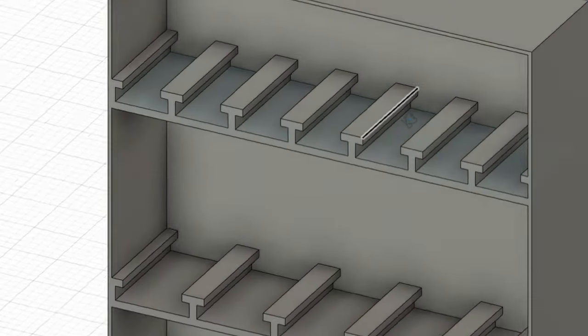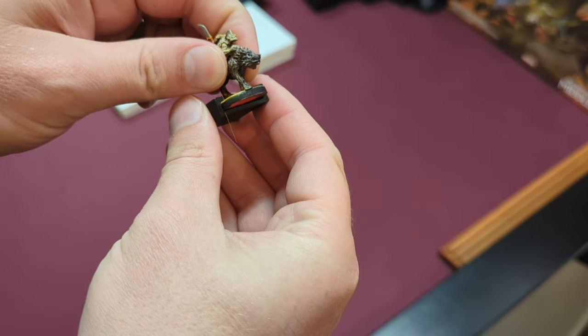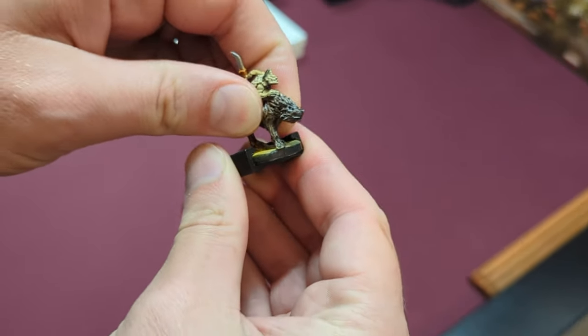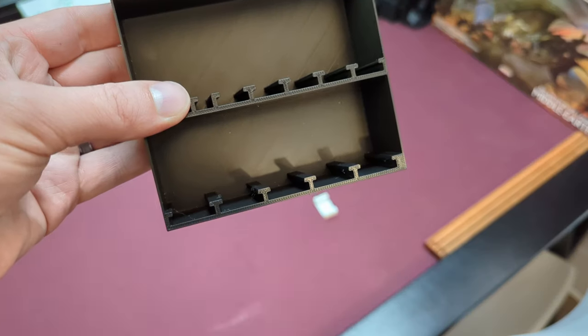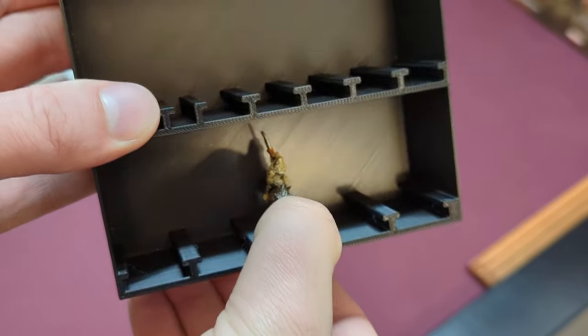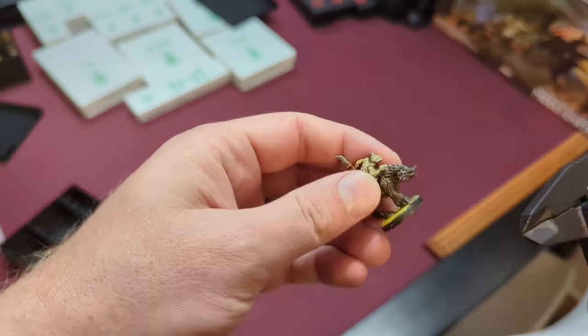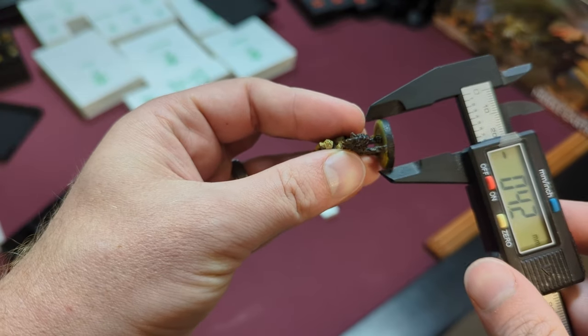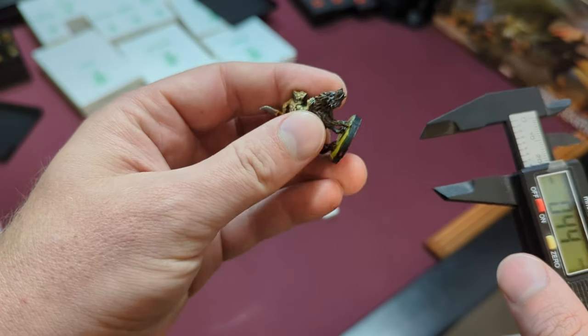Here's the first of many mistakes. It took me several tries to measure and get the right length, width, and height for this channel to make sure it fit just right. What worked for me was using calipers but then adding a couple of hundredths to that measurement to give it some wiggle room — too close and it doesn't fit, too wide and it's too loose.